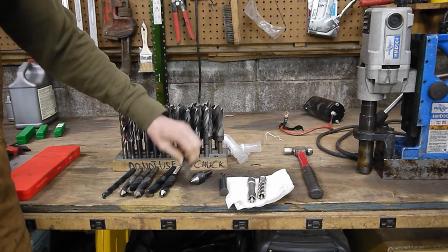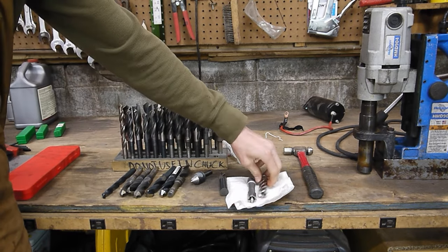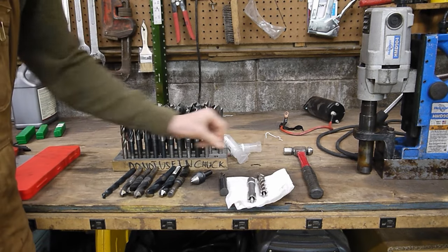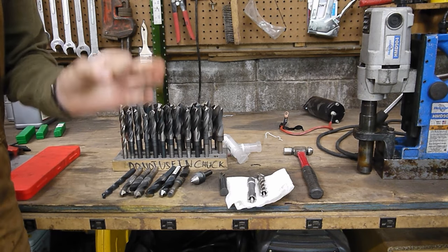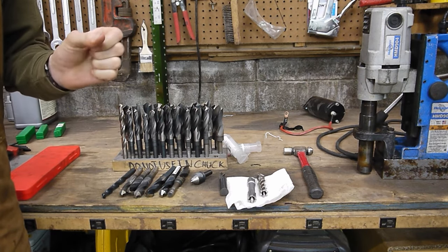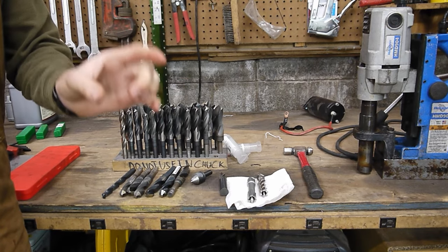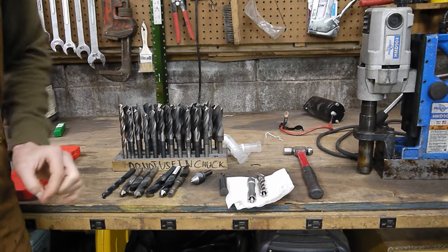So I'm either going to finish with a typical 3/4-inch drill bit or the 3/4-inch annular cutter to just take that final cut off the edges. The main advantage of a reaming bit is it follows a hole, it doesn't cut a hole, so you're not going to enlarge your hole. If your hole is slightly on an angle, it will follow it and make that whole slot a 3/4-inch hole.